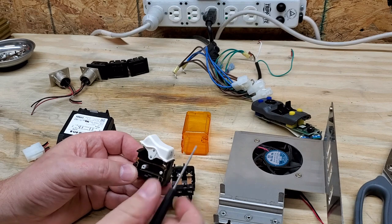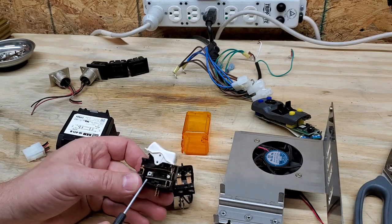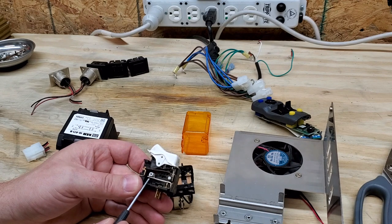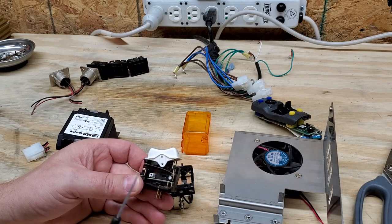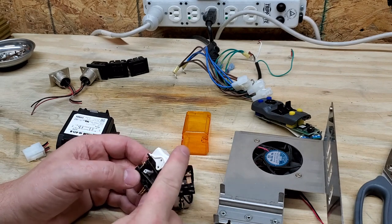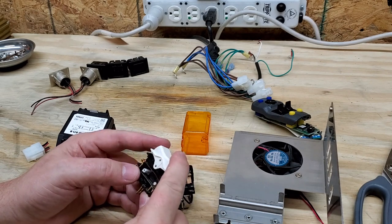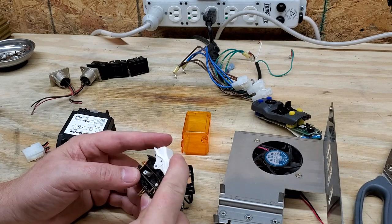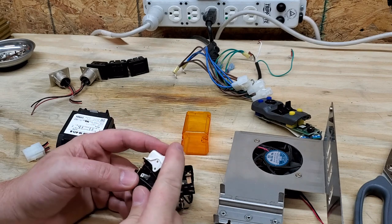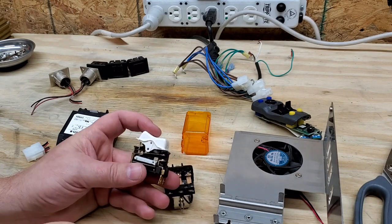So let's try that again — power on, contacts are closed. The bi-metallic strip, if you go over 10 amps, starts to get warmer until it lifts and it trips. Here's the thing about these type of power buttons: when you go to turn them on they often will not latch, and the reason being is because you have to go all the way off and then all the way on, and then it will latch.